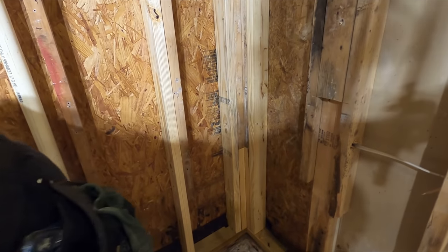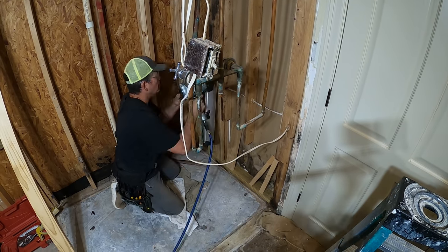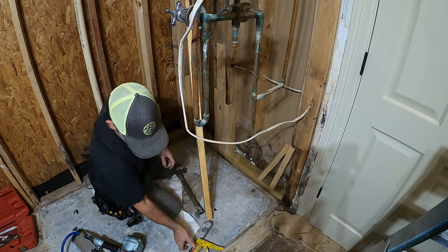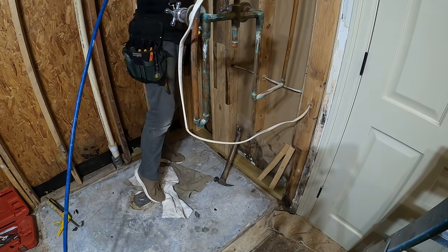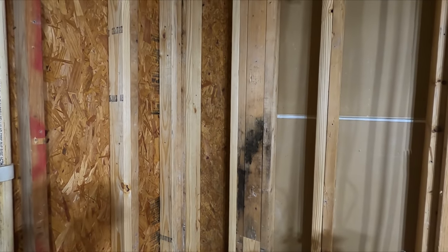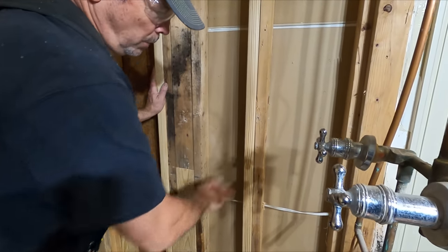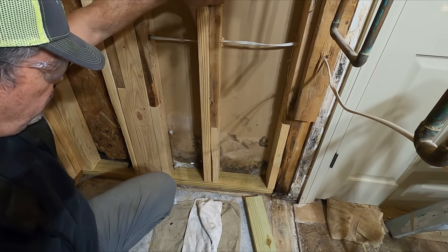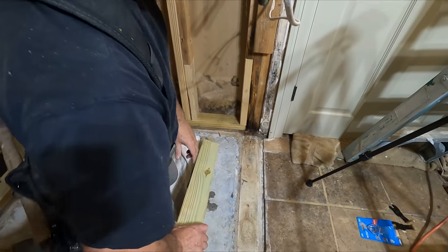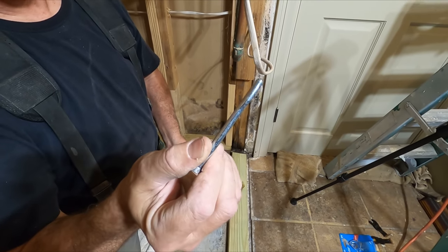It looks way better than it did before. Let's put this little guy in and then we'll do that wall. All right guys, we've got this repaired — check it out. You have plenty of backing for our new backer board, plenty of solid backing. With this stud going all the way to the top and the glue, all sistered onto our little repair piece — it's great. So let's build this wall real quick. Right here we've got a piece of treated. We're going to fasten it to the slab with our favorite anchors — kind of a drive anchor. Let's get it done.